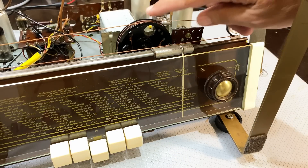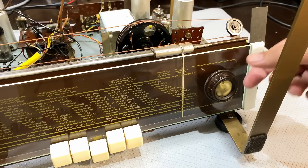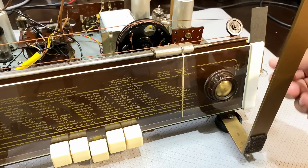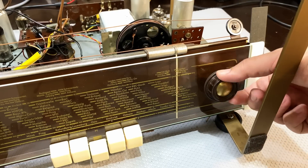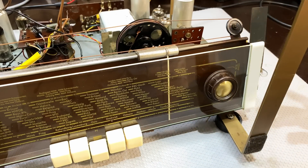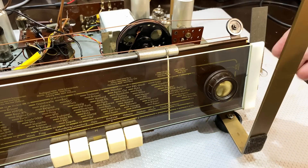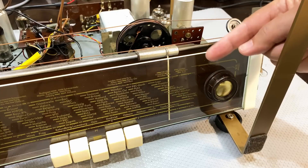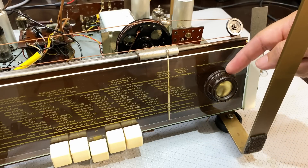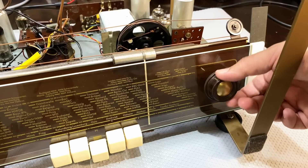One of those things was the dial cord. When I rotated counterclockwise, this thing was coming to the right; when I did it clockwise, it was going to the left. It doesn't make much difference as long as you know the convention, but it just doesn't feel right. So I had to correct that. Now you can see counterclockwise moves left, clockwise it moves right. The cord coming down going anti-clockwise has been removed and is now going clockwise around the inside of the knob. So we've got that sorted out.